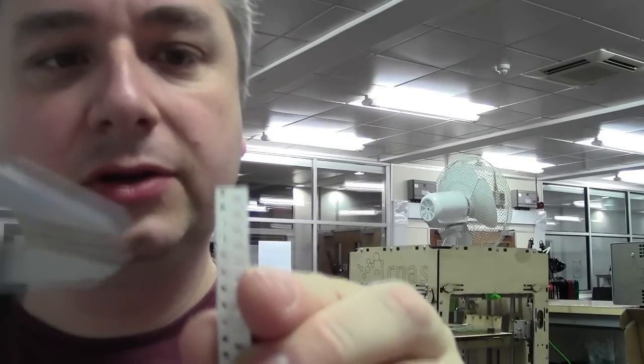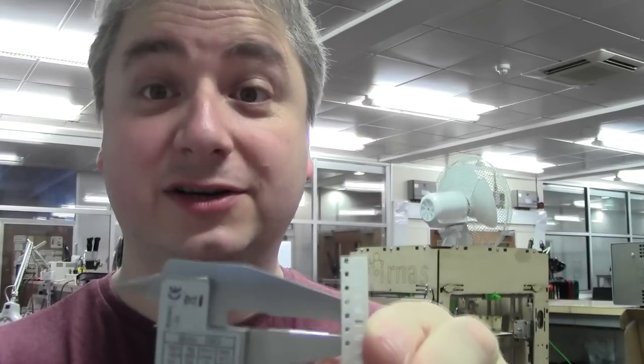Now when you measure your carrier, on the data sheets it shows you from the centre of the carrier to the centre of the carrier your pitch for your feed rate. I don't like doing that because trying to get to the centre is, you know, it can be quite tricky. It's going to be a large error to that.